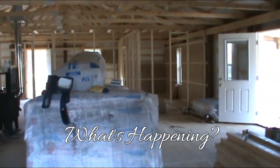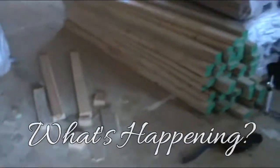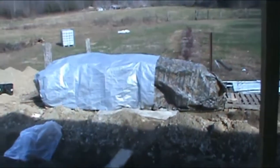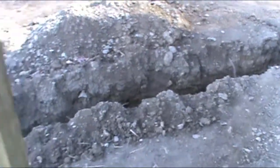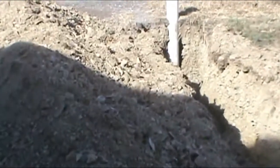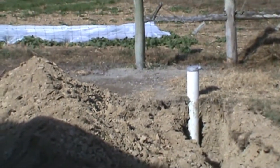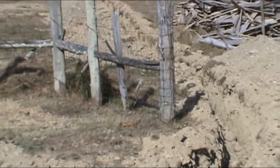So, update. We've got some interior framing done, and we'll do more on some rainy days they're forecasting soon. Got some firewood covered. Still don't have the pump yet. We ordered what's called a simple pump — the manual one. We're going to put a pitless adapter down on the pipe buried underground, and we will hand pump our water directly into our pressure tank. We will not have an electric pump, so we'll have to go out every day and pump water into our pressure tank, which is just fine with me.